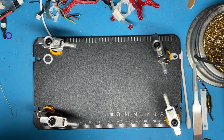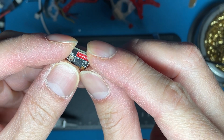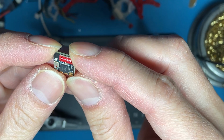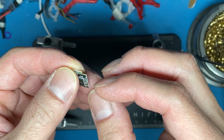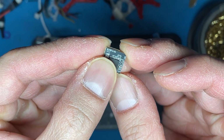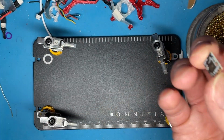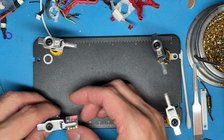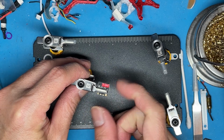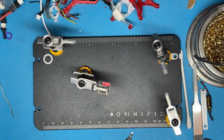So again, what we're talking about here is the flat red antenna on the top here. It has pretty bad range, I find anyways. There were some posts that said there were new revisions of it that were better. I believe I did have a version, I don't even see that, version 1.1. I believe the one that I modded was also version 1.1 and it sucked too. So I'm not sure what that information is about, but we will try to remove this antenna with an iron on top and see if that post is accurate.